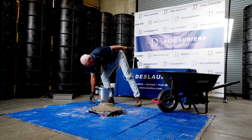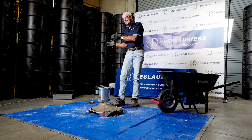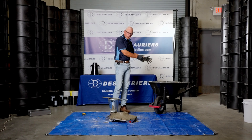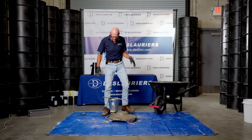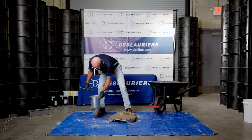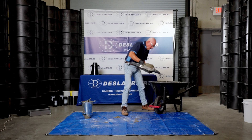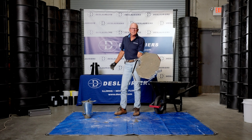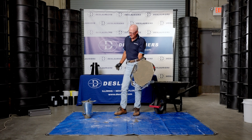When you're doing a slump test, ASTM C143 and C31 — the standard for making test specimens — allows you to reuse this concrete. You can take it, put it back in your sample, reintegrate and remix it, and then use it to make test specimens for strength. Take the used concrete and dump it right back in the wheelbarrow. You don't want to leave this laying around long — get it cleaned pretty quick. Thanks for watching; if you have any questions, call our office.